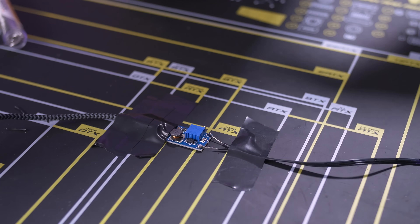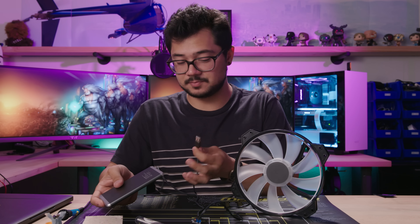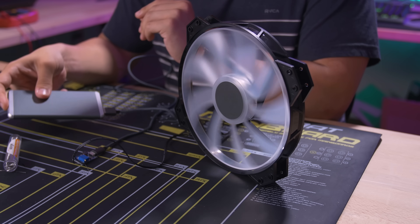It's not the finest soldering job, but hopefully it's enough. Now we can let the solder dry for about 30 seconds or so. We can test my soldering job by simply plugging our USB cable into a power source. It works! It works. Feeling cooler already. It's got a nice kind of breeze to it and it's fairly quiet too. Good job, Cooler Master. Definitely feels like it's operating at the full 800 RPM.